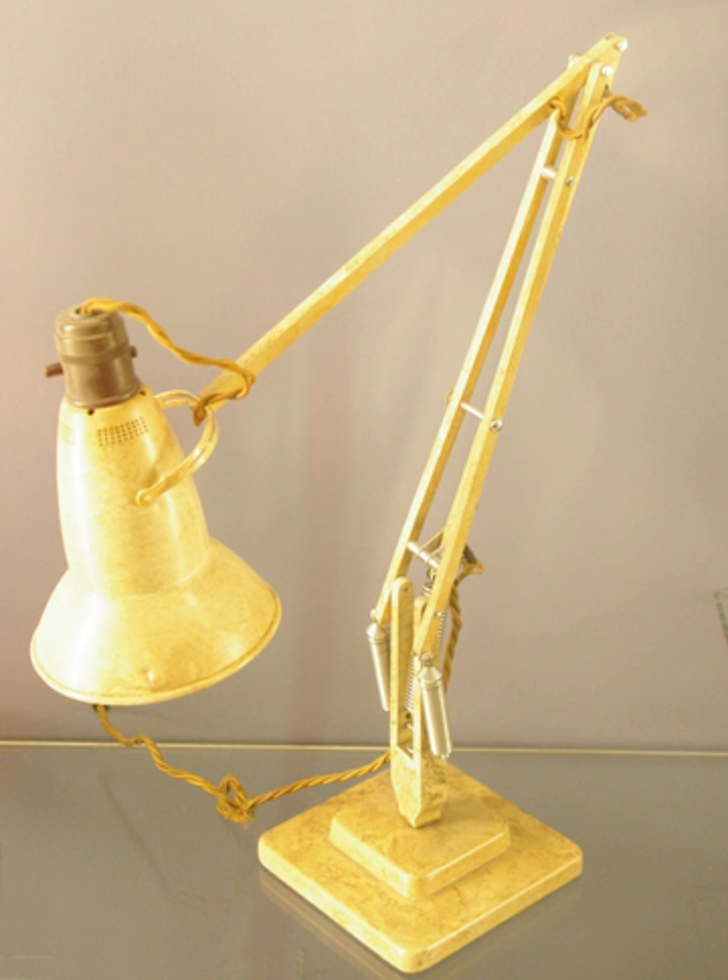Compression springs near the foot: one compression spring controls a very short arm (gray). The roller chain cable connects this arm parallel to the forearm (yellow). The longer spring controls the blue arm. The body (red) can turn in the horizontal plane and is connected to a stable foot. The body can be smaller because the pressure springs can protrude below the body. A compression spring with one parallelogram: just one compression spring controls a pantographic arm. This construction is quite common in Italian lamps.